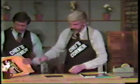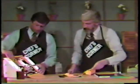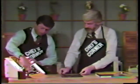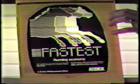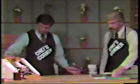Let's put it up on our little light table here. I think I'll turn it this way. You can see that only that which we want to print is exposed through the cutout, but now it's masked and it's square, as to where we're going to position it on the plate. Absolutely. Okay, so we've now prepared and opaqued, so this is actually ready to be imaged. Is that correct? That is correct.